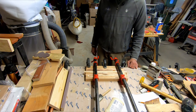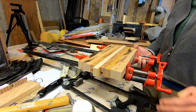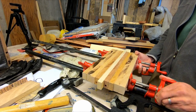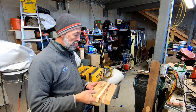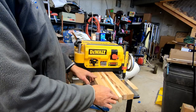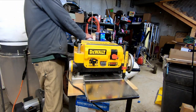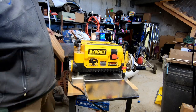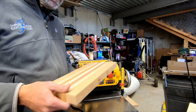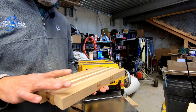This Tyvek tape releases from things pretty well, so we'll let that glue up overnight, and then we can plane it, cut it, and do whatever we want. We've let the glue set up overnight — now we're going to unclamp everything and get it ready for the planer. If you don't have a planer you could sand, but there's quite a bit of sanding. We're going to use the thickness planer to even everything up. A few passes through the planer and look at that surface — very even, just needs some sanding.